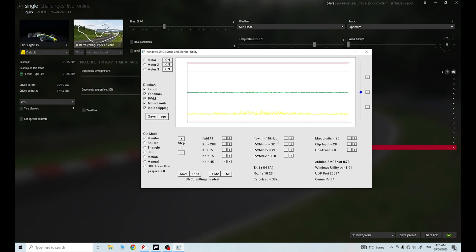See how I've got it on 15 kilohertz now? This was set at 35 kilohertz for motor one and for motor two. I did not realize that the IBT2 and the MOSFET chips that are in the IBT2s - they're only rated to 25 kilohertz. I didn't know that, guys. That was just ignorance. I'd never seen anyone talk about that before. I just stumbled upon this. So immediately I thought: well, that's probably not going to be helping my IBT2s.